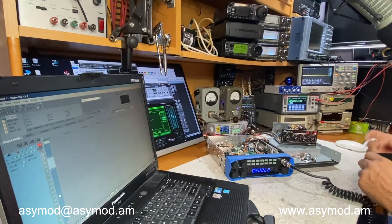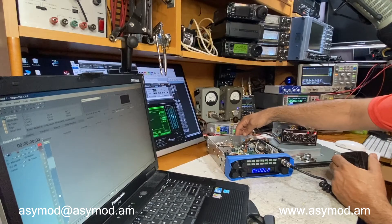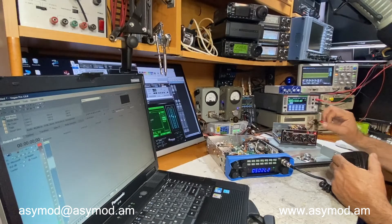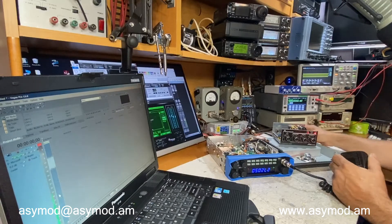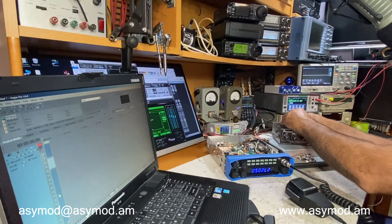That's a 50-watt slug, so we'll set the carrier — we're on low power at the moment. We'll set the carrier to about two watts right there, set our reference here, and we'll start the signal generator. Of course, right now we have to plug in the line-in connector for the signal gen.